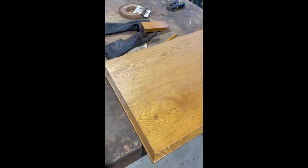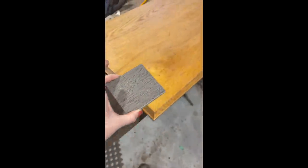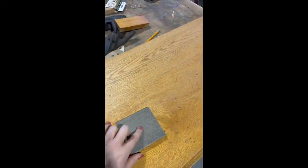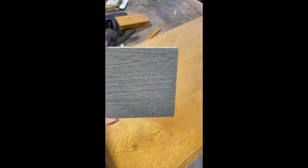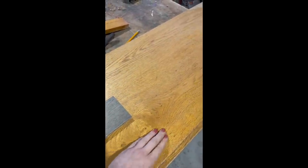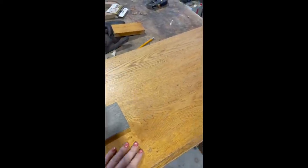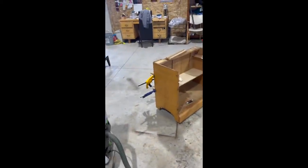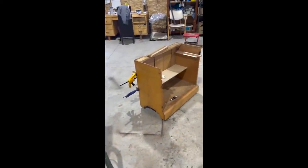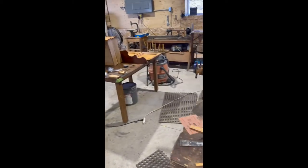The top looks like it's in pretty good condition — really not that bad considering. But what I'll do, just because I like my top finishes to be super durable, is probably strip the top before I do the lacquer paints. That way I can get good adhesion. And also, our stain color is a lacquer paint with a black glaze — I want my black glaze to be able to sink into the green to get it to look like this sample. You can see there's a lot of black in the green, so if I strip this, I can open up a bit more of that green and get a better match. It's a can of worms like most old furniture, but I do get carried away because I have way too much fun.